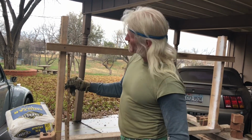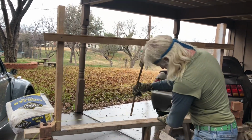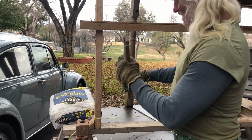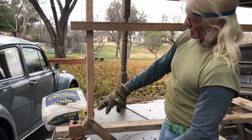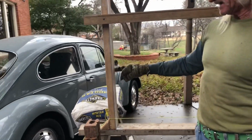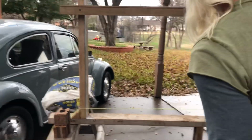Anyways, measure down 9. Now, you go all the way down to the footing, which is what this represents here. And you see how it works out to your soldiers, which I made this work out. So it's going to be 3 inches. You can see I've marked C, C, C, C, and C. That's 1, 2, 3, 4, 5 courses. Same thing on this side here.